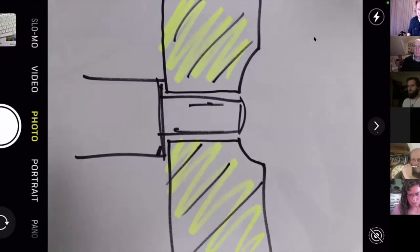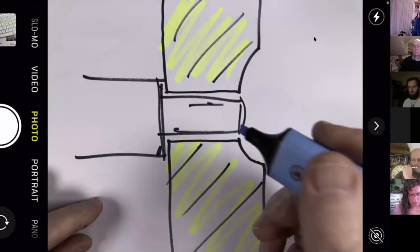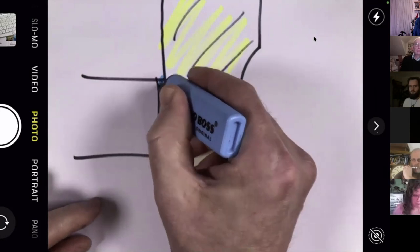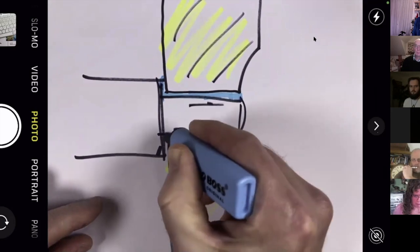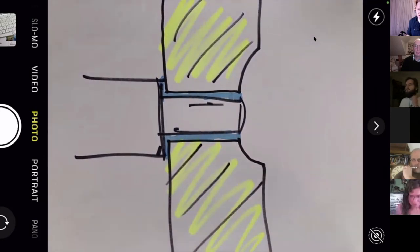I mean, this may seem kind of common sense. So the oil runs into the bearing. If you oil underneath and you leave a tiny oily mark on the plate, what tends to happen is gravity tends to draw the oil out of the hole and it runs down the plate. So enough oil, it's kind of a question of judgment. What happens is when you oil it, and I'll draw the oil in blue for some reason, capillary action draws the oil into the bearing and it forms a little meniscus.